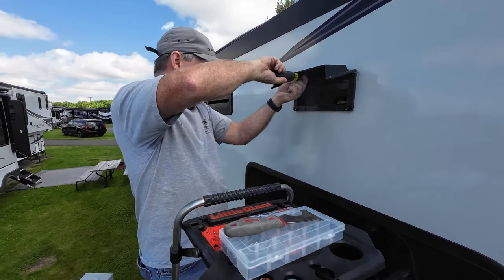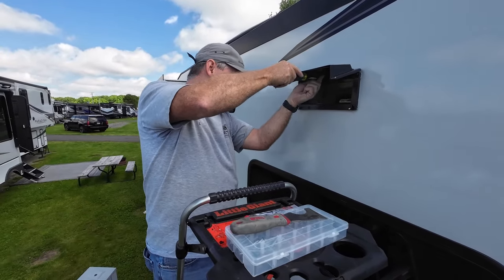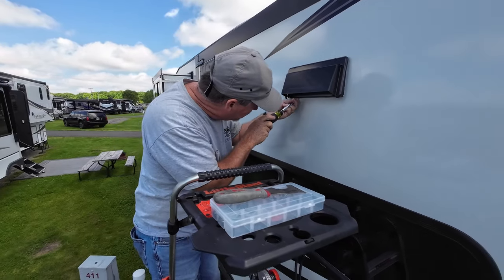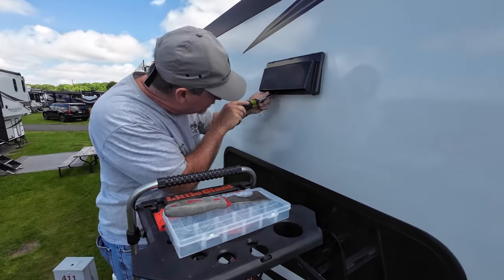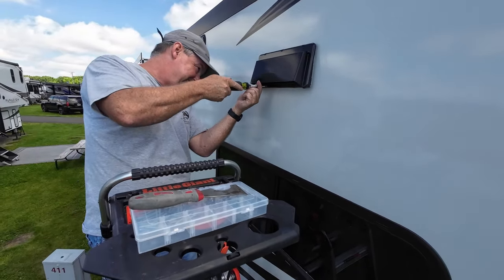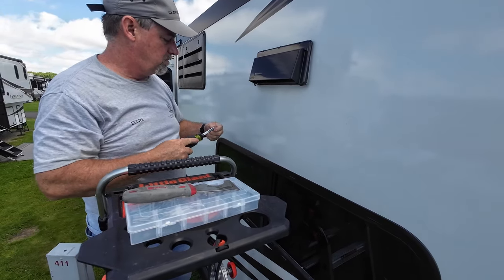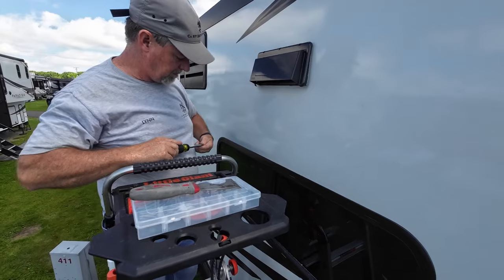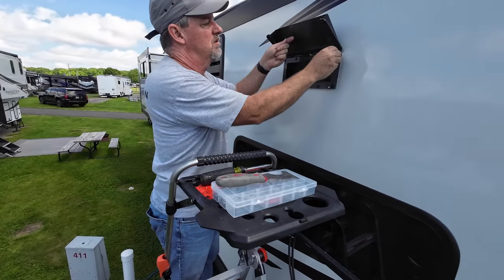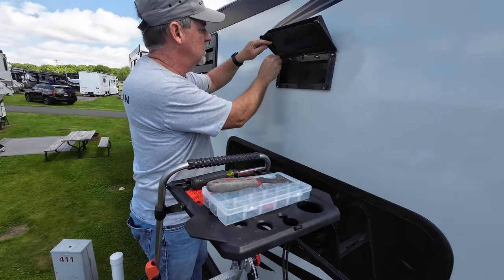And this is definitely a location where you do not want to use a power drill, because when you strip these out, you're done. And I don't want to do that to the exterior of a coach. It's pretty unrepairable and needs other workarounds. Most clients wouldn't like that anyway. One of the benefits of the butyl is you can actually preset your screws without having a magnet.